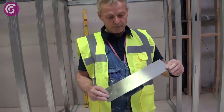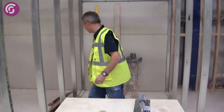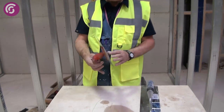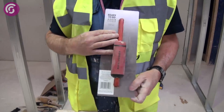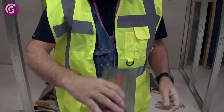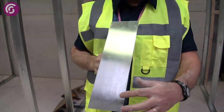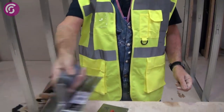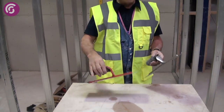This is another type of trowel for another aspect of plastering called floor screeding. If we look at a skimming trowel, it is very flexible and much broader. If we look at a flooring trowel, it is narrower but a lot stiffer and slightly longer — this allows you to do long sweeps across your floor screed as the work progresses.